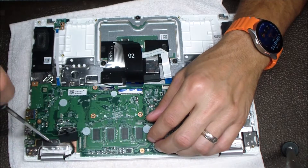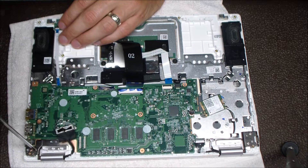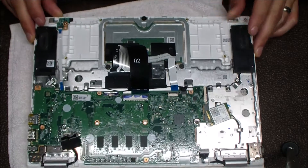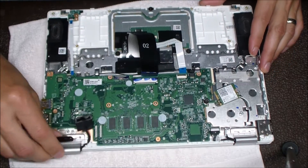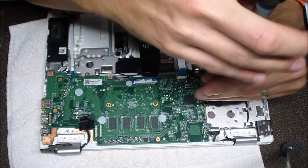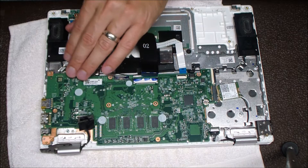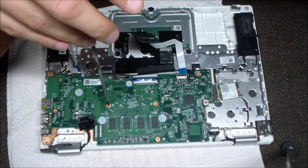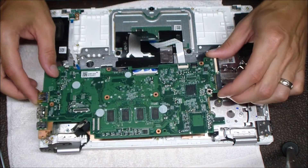Here I'm going to remove a couple of hinge screws. The hinge is folded over on top of the motherboard, so if you remove the hinge screws you can open the laptop up a little bit to get that hinge started. Once that's started, you can take your thumb and move it up the rest of the way to get that motherboard clear. Now I'm going to remove three motherboard screws — they're all three in the middle there, a big flat one and then two small silver ones. And once I've done that I can take the motherboard out of the chassis.